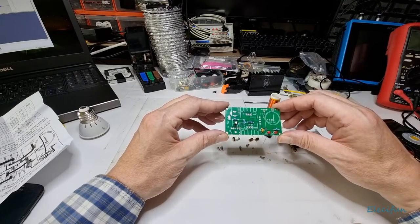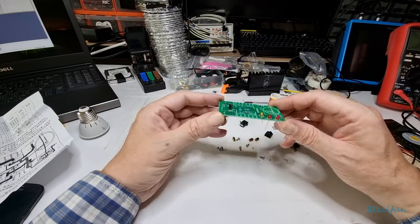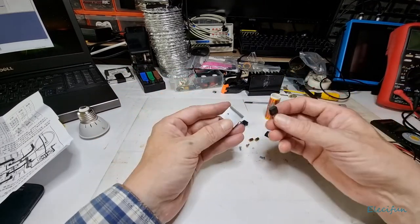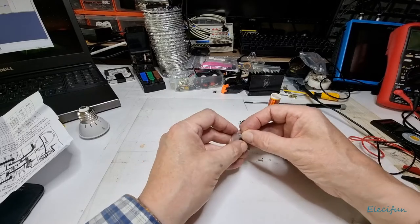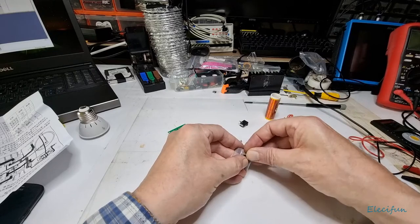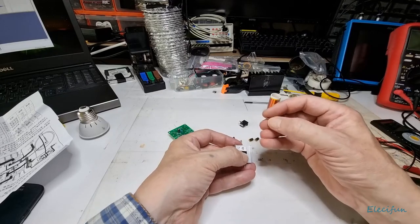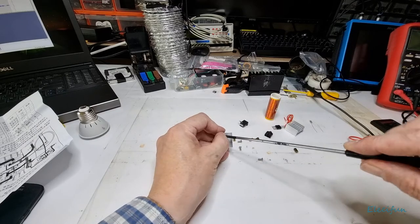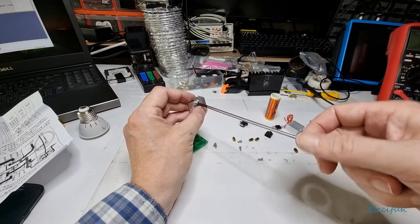All right, so we can just quickly solder that up. I'm not going to bother putting any thermal paste on the heatsinks for now — the coupling should be enough for what we're doing. But if the MOSFET or transistor is getting way too hot and the heatsink isn't keeping up, then couple it with some thermal paste. For this, I'm not going to worry about it too much.